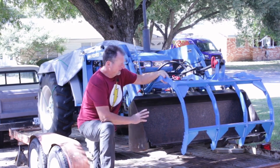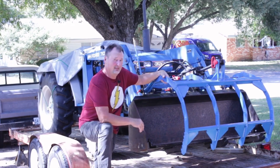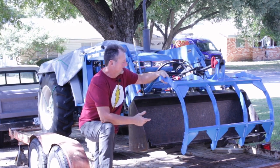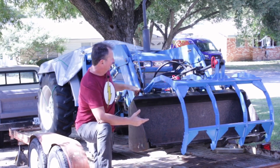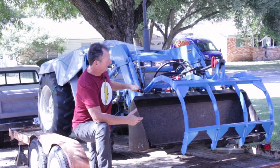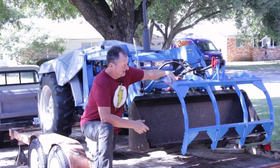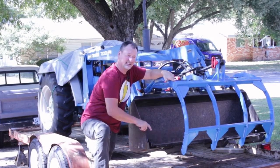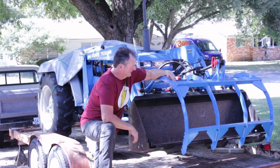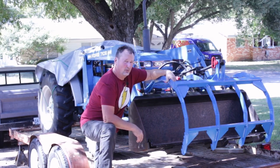And this altogether on the front of this weighs probably 250, maybe 200. That's going to decrease from the capacity that it can carry, but it's really easily removable. There's pins that come out here on the top hinges, pins on the ram, and this lower little bar on the bottom, it has 4 bolts and it slides off forward, so that I can just retain the bucket use as normal. So I'll show you how it works. Check this out.